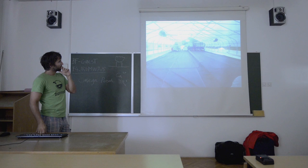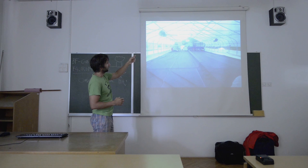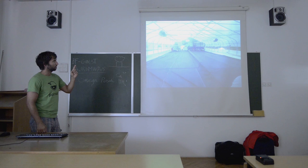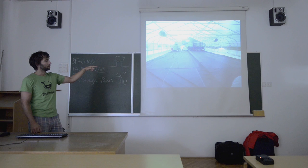Another problem I can see here is that the installation of electric cables wasn't finished, and later on, when they came to finish it up, there was a big problem because they were drilling and the drills were falling onto the foil, which is a big no-no in the future.